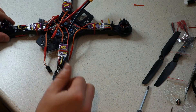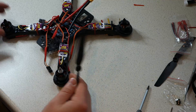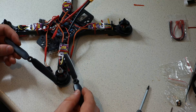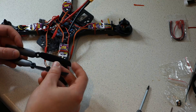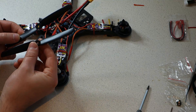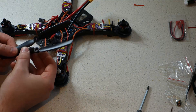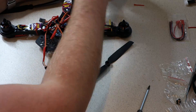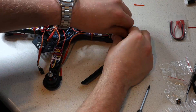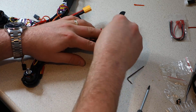We're now ready to fit the propellers. Take note of the difference between each propeller in a pack — they're designed to spin in opposite directions, with the leading edge of each blade always being higher than the trailing edge. I'll include a diagram with the video explaining which propeller goes where. As many experienced multirotor builders are probably thinking right now, take the props off again before plugging in your battery for setting up your flight controller.